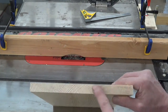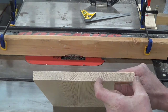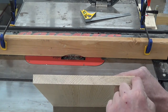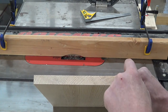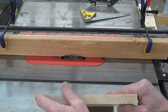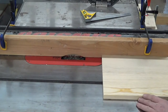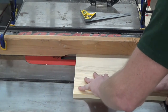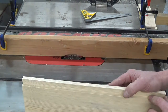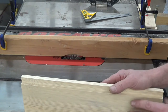Next, I'm going to determine which edge or corner I want to put the rabbet into. This grain here is plain-sawn and is highly susceptible to warpage. I've discovered you do not want this at the top of the box — it works pretty well down toward the bottom with the bigger box joints to hold everything together. For our rabbet, we want it in as much quarter grain as we can get. So I'll put it on this end, then decide what I want to be inside and outside. Now I have a 5/8-wide by 3/8-deep rabbet in the top of my ends. I'll do this to all my ends before moving on.